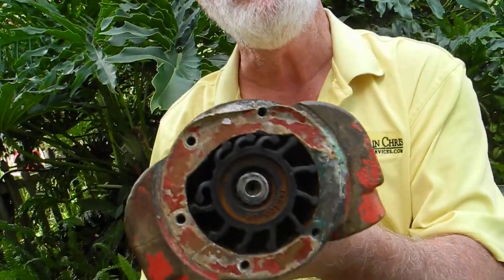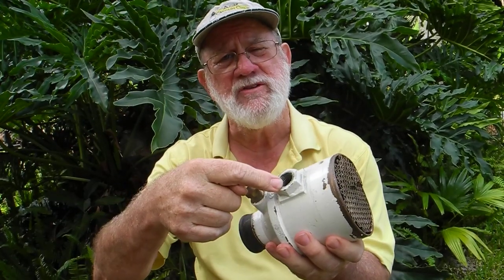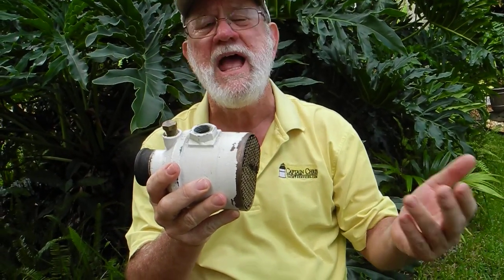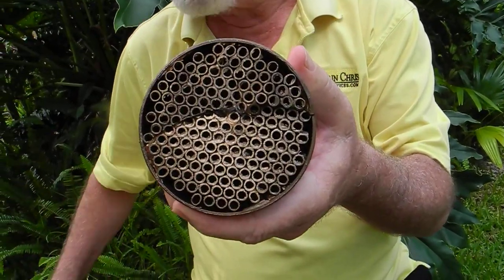This is what's used on most boats for the raw water cooling system to pump water through a heat exchanger or multiple heat exchangers. I've got a heat exchanger right here. So this is called a tubing bundle in a shell, or tube in shell. And the water goes in there, the antifreeze goes in here, and then you can imagine that there's more over here, the other half of this, where the cooler antifreeze comes out, and then the warmer water goes out through the exhaust system.